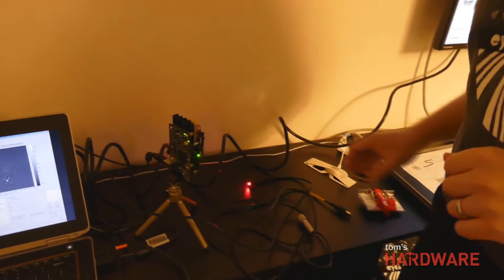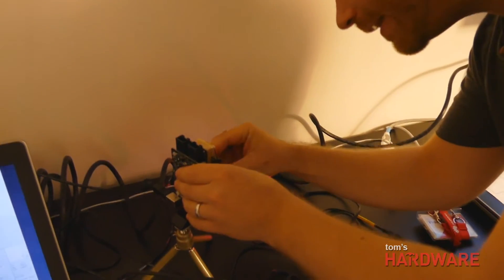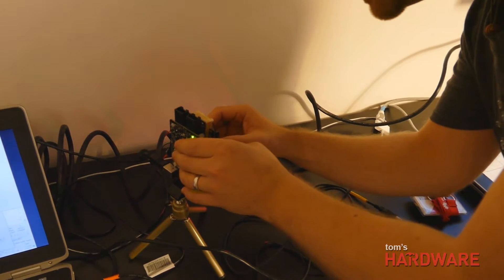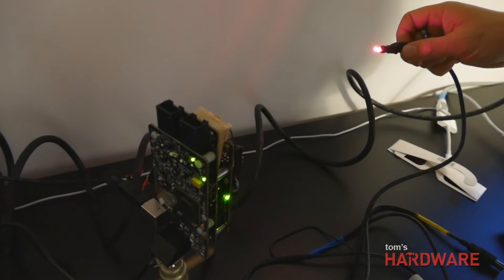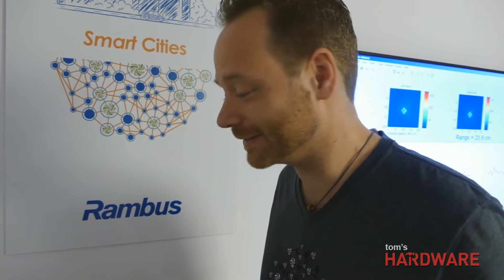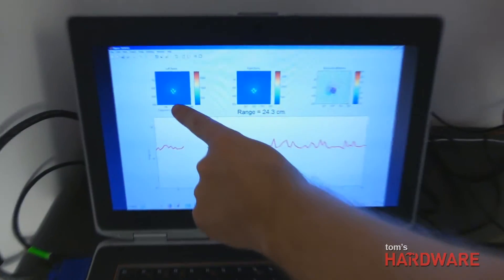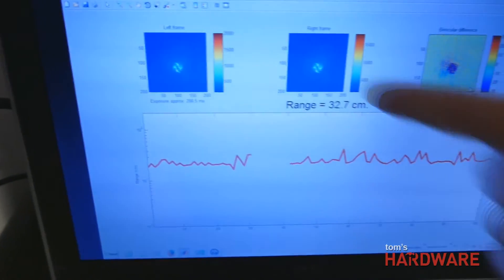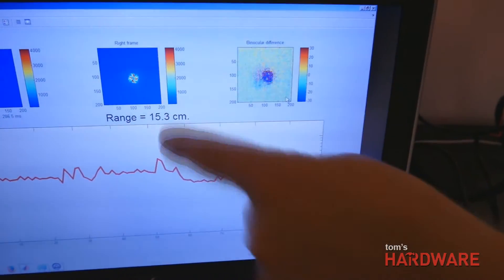For my next demo, I'm going to show you exactly that. I'm going to take this red pass filter and screw it onto the top of this sensor. I have a red LED and an optical filter which lets red light through to the lensless smart sensor. On the same photodiode array, I have two lensless smart sensors spaced by 1.86 millimeters — extremely close together — which is trivially easy using this planar manufacturing process with standard CMOS. Here you have the outputs from the left sensor and here from the right. By aligning these two spirals together, you can compute the range, which is shown here, to this light source.